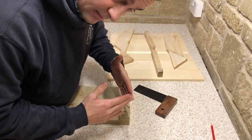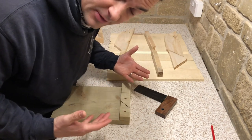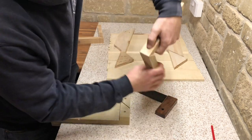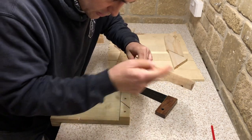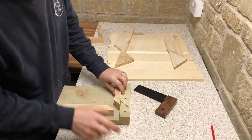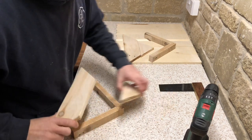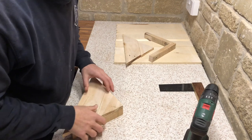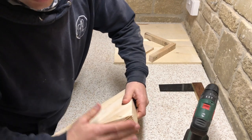The screws from the shelves and the back are going to hold it tight, so you only need to hold it together for now. I don't want to put a screw in there as well because any of the other screws going in the back could hit into it — it's just not necessary. So same as before, put your support, then take your two shelf pieces and fix them onto there. If you've measured this right, they should all marry up perfectly like that.